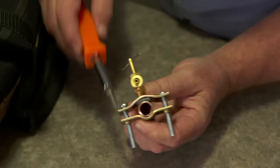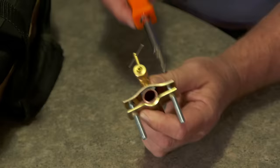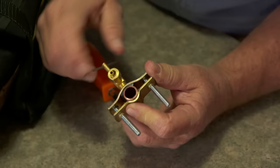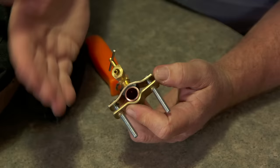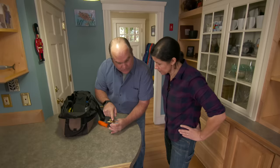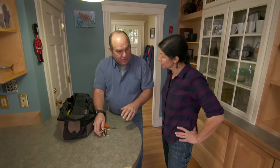In that kit was this valve right here. There's a lot to love about it, but a lot I don't like. It's called a saddle valve — it has a bracket on both sides and a little rubber gasket. You put it on here nice and easy, all you need is a screwdriver. But it actually punctures the pipe with a sharp point. The problem is this bracket is not made of brass or copper — it's regular metal that's just coated. If it ever rusted, failed, or let go, you'd have full city water pressure leaking everywhere. That's why everyone has problems. A plumber can't use this legally, at least in this state — it's just a big insurance claim waiting to happen.